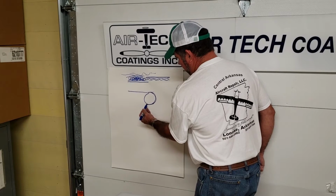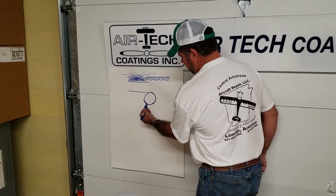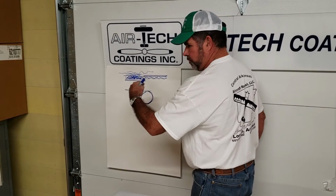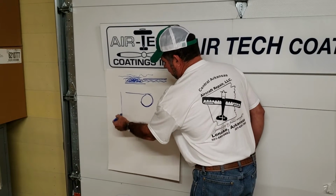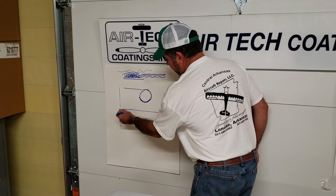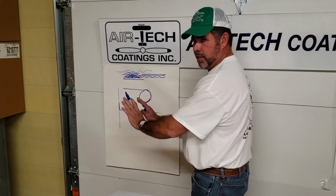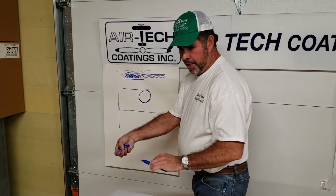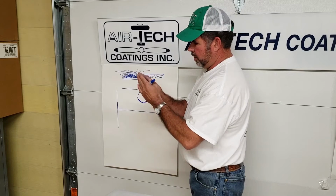And really it's not going to hurt if it wraps on up inside there. That's not a concern. What that's doing is getting a lot of sideways shear for that to come off. If you had a wall over here and you had fabric going into it, and then you went right into it at 90 degrees and turned it up and glued it, that wouldn't be a good hold because it would be trying to peel away. You're always wanting to wrap around something.